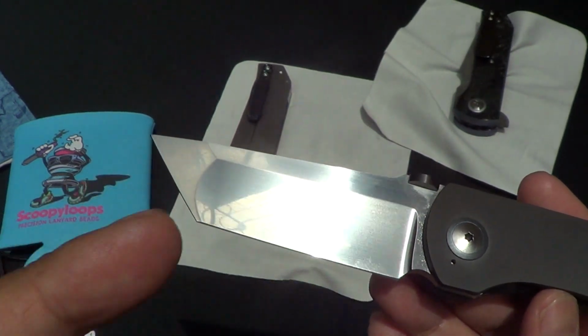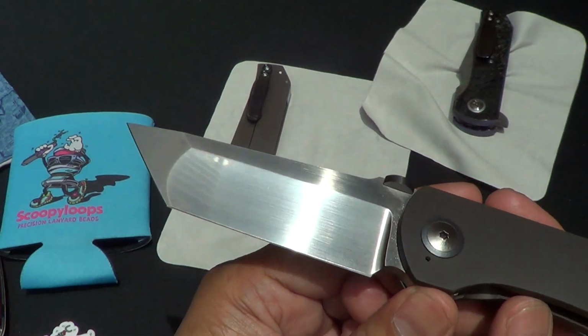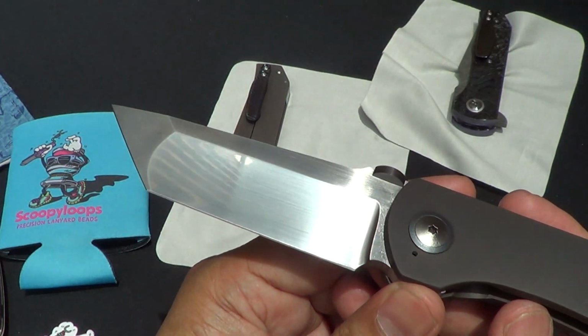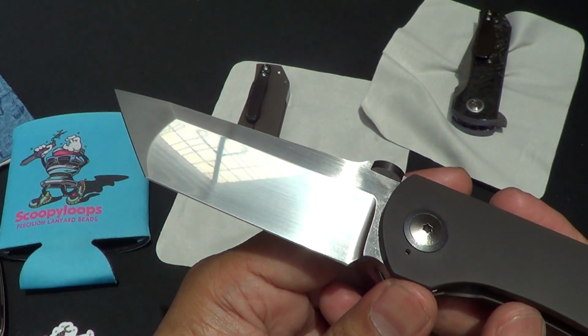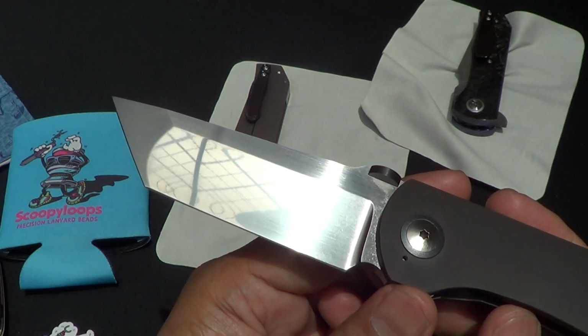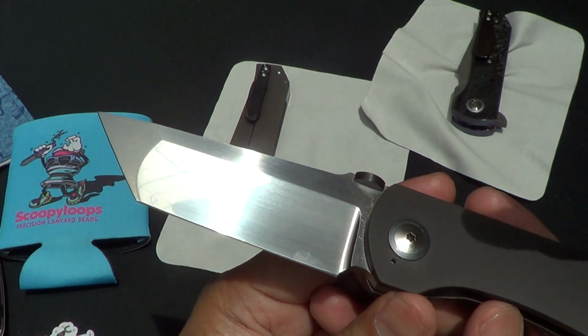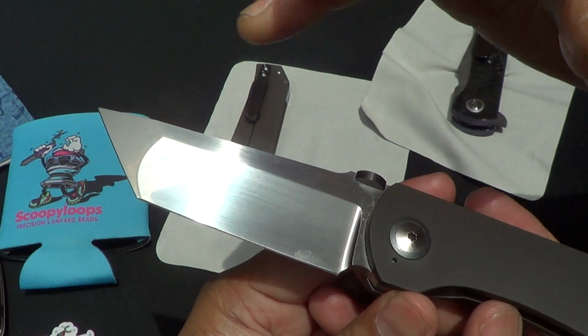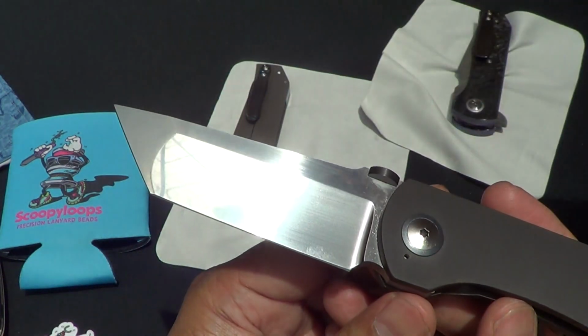So how much time do you invest in making a hand rub steel? Once I bring the blade to a high 1200 grit, the scratches polish right off the grinder. It's like another 6 to 8 hours worth of hand rubbing. That's one of my favorite knives. It has to be done in steps. You have to hand rub the bevel before you grind the tip. That way, this line stays very sharp and crisp.